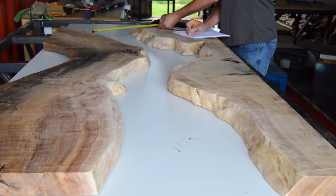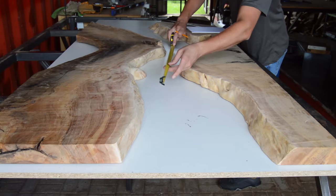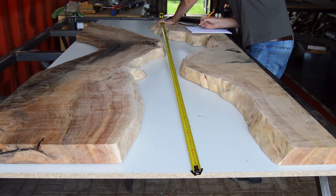With the rice method, you remove all the rice, add it into 20-litre buckets, and then you'll get a good idea of how much epoxy you're going to need. Once you have the volume of your epoxy table, you can use an online calculator to convert your volume to litres or to kilograms.